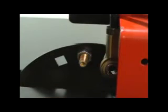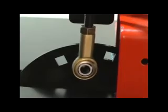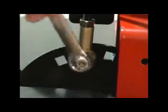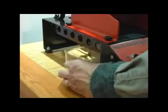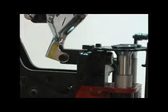With a 1/2 inch end wrench, remove the nylon lock nut from the actuation wheel pivot point. Attach the bottom end of the pull rod and tighten the lock nut. Install the spent primer bin under the Automate base frame in the location shown. Now we need to install the left side truss rod.